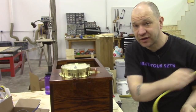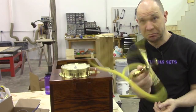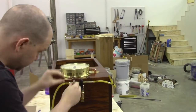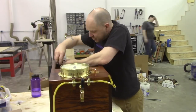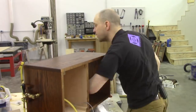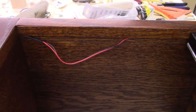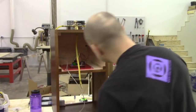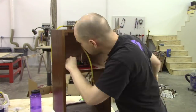Step number next, now that the air compressor has stopped compressing and you can hear me, is the addition of this little bit of wackiness. For this component, we are reusing some of the original mounting pieces. I had to re-cut some oak that they go onto, but they are original pieces — always better. The electromagnet is installed right behind the handle, as we like to do, because it's stronger. There's a trough that we cut back behind the face frame, and the wire just slides right into that. I've got pieces cut out with all the right holes and standoffs for all of the Arduino and for the protoboard, and there's another similar custom-milled piece for the fan, so everything fits snugly and out of the way of wires and hoses.